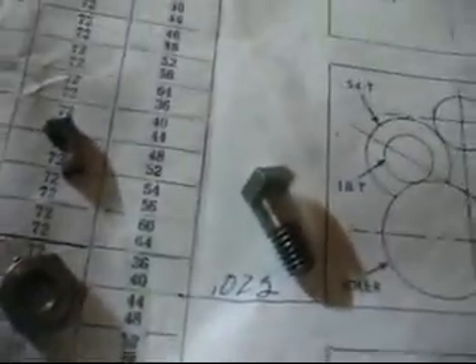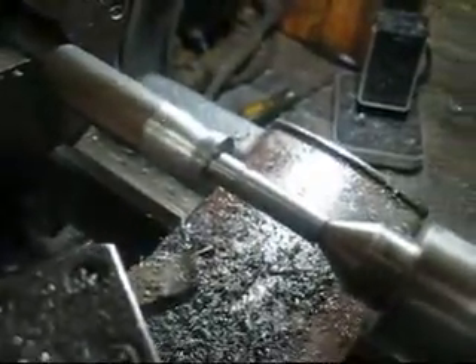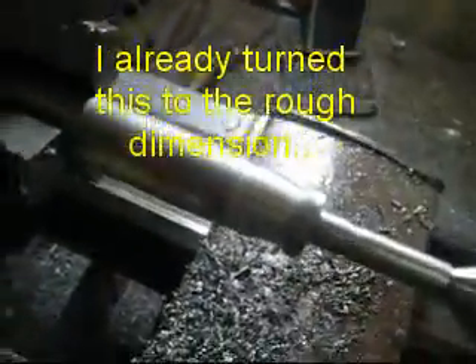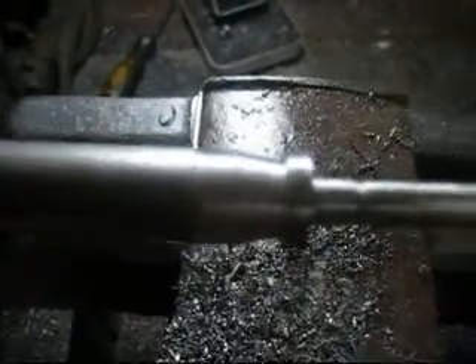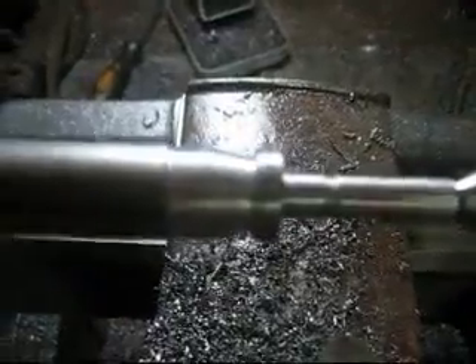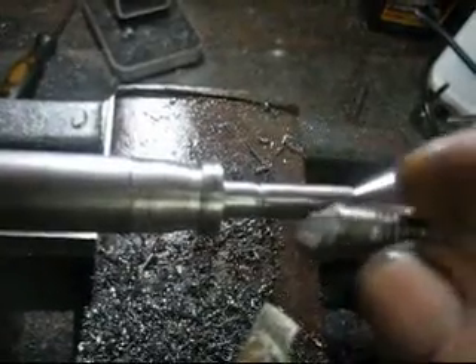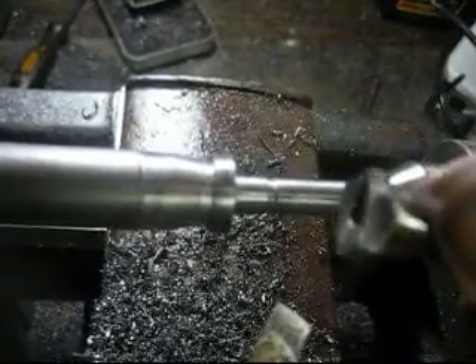This is a much bigger circle - like six or eight inches. What I'm going to do is make a round-headed bolt from this drill rod I got. I'm hoping it'll be strong enough, and it's wide enough here to make the head of the bolt. I want to make one side convex and the other side concave, to get as much of a head on the bolt as I can. I don't know what the original was made out of, but I heard it snap - I was tightening it pretty tight, but one of them always felt loose so I think one was already broken.